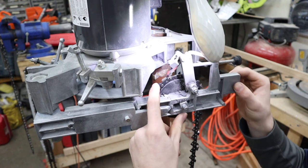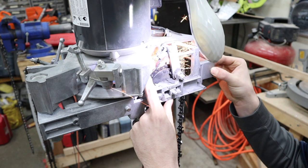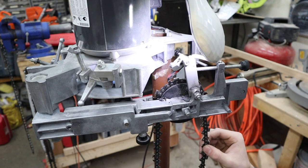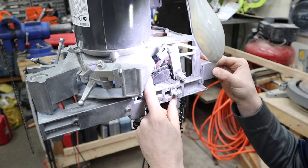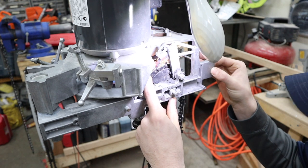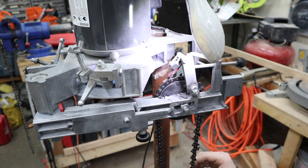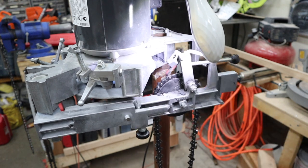Ethan runs his race grind at about 30 degrees — that's about the traditional angle you would use on any chain. But the work grind is at 20 degrees, a more blunt angle. The grinder itself is limited to a certain point and you can't really go past 30 to 35 degrees, so you can't get crazy with a steep angle. But you don't need that with the square grind.